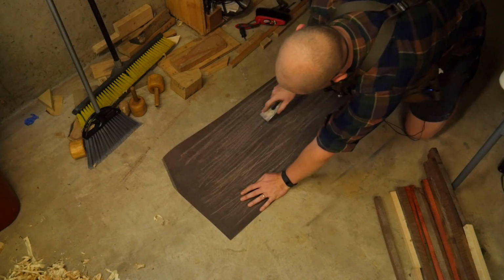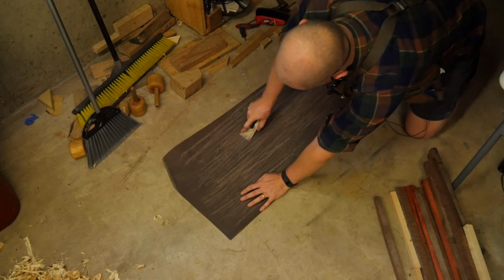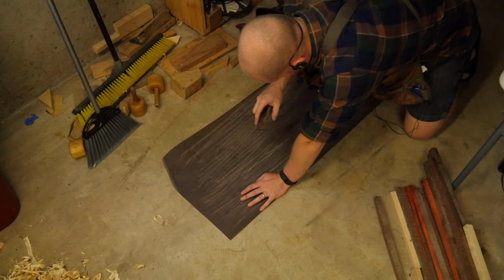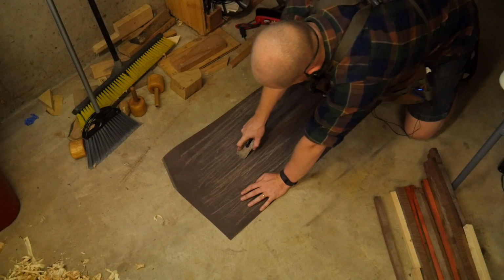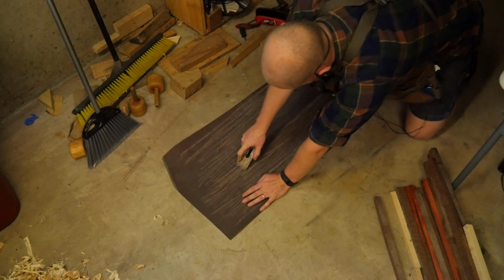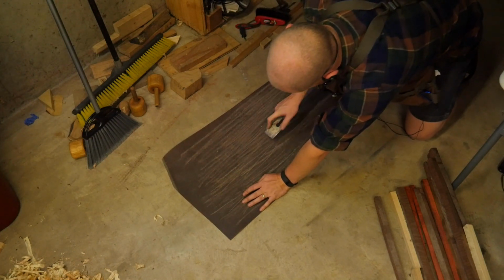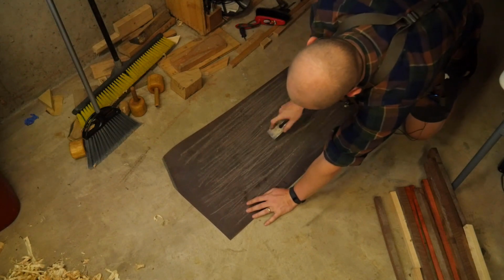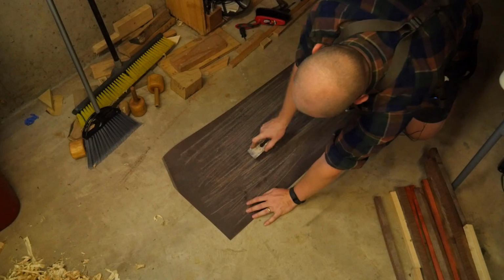I don't worry about being on granite. I'm doing a cambered iron. I'm not worrying about it being flat, so the concrete is perfectly fine. Just occasionally checking it to make sure I'm not going over the line, and keeping the bevel by holding my hand at the right angle. It really takes about 5 minutes. It's fairly quick and fairly easy, and not much slower than the grinder.